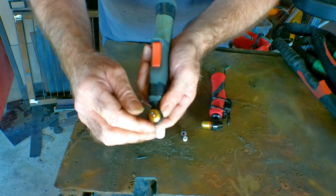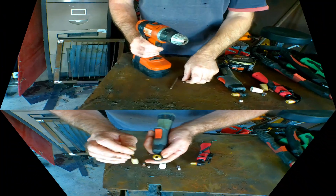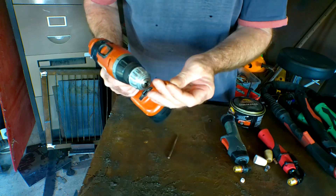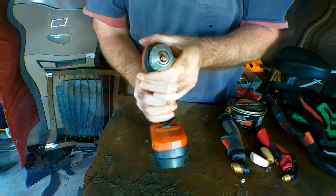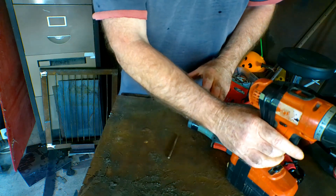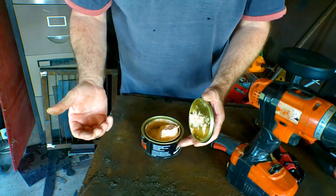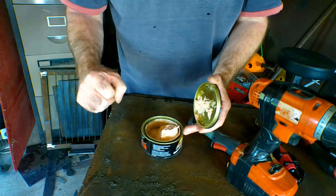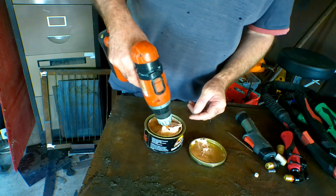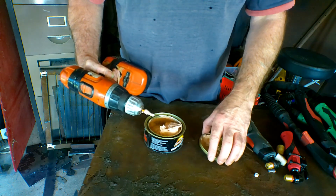So the only way to fix this torch really is this little hack that I'm going to show you — this is what Pete does when they go like this. What you need to do is grab your double-ended cutting electrode. Doesn't matter which end you use. Tighten them up. And then whatever you happen to have handy — at the moment I'm polishing the car, so I've got some cut and polish. Or you can use Ajax or kitchen cleaner, as long as it's abrasive. You can also use Brasso, whatever you've got. Stick your electrode in it and get a nice pasty coating on it.